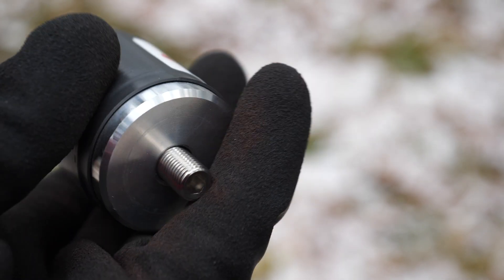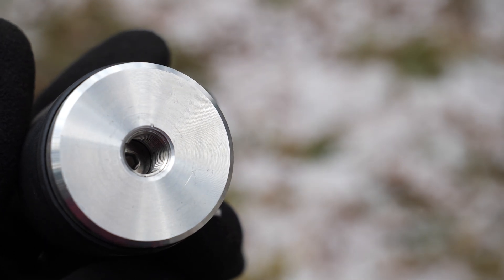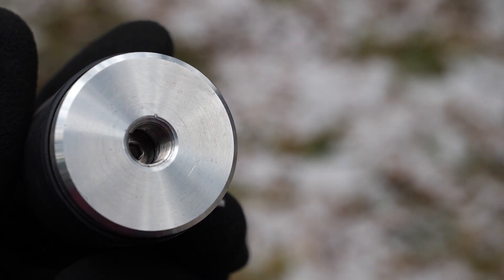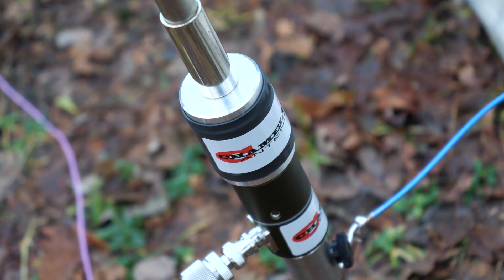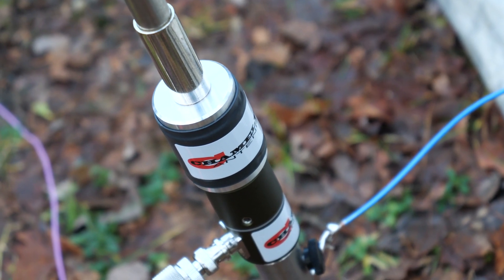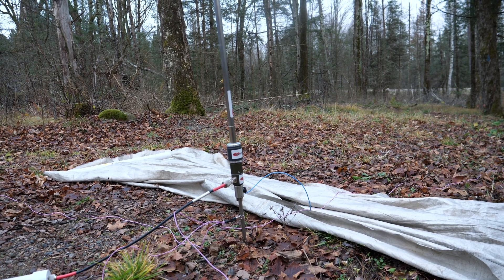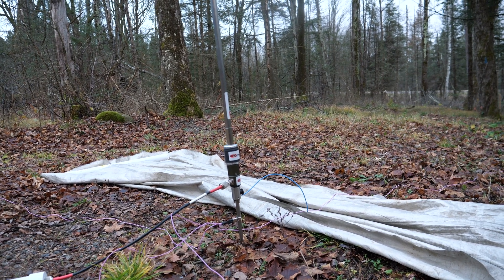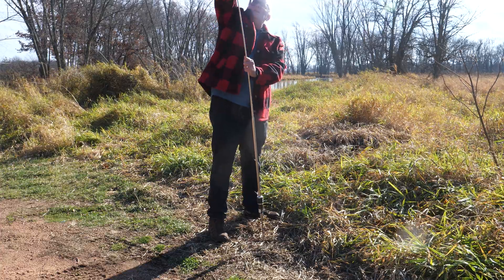In the middle, underneath a heavy shrink wrap, is the inductance coil. The M coil is rated for 100 watts digital and 200 watts CW. To use the coil, place it above the Chameleon Blank Adapter or another suitable antenna mount and attach the SS17 17-foot whip above it. Add suitable ground radials or even the magic carpet-like Faraday cloth. Fully extending the whip, your radiator should be resonant on the 40 meter band.